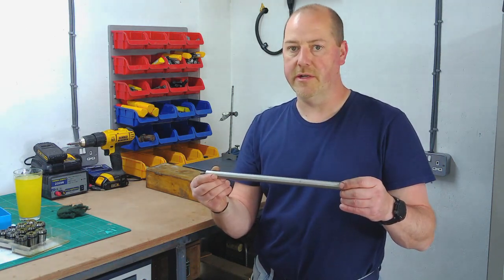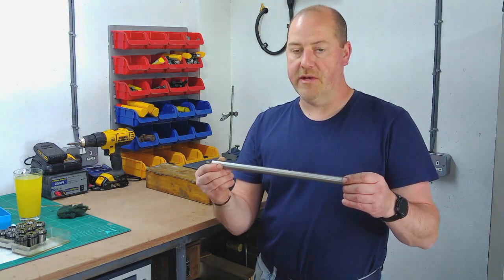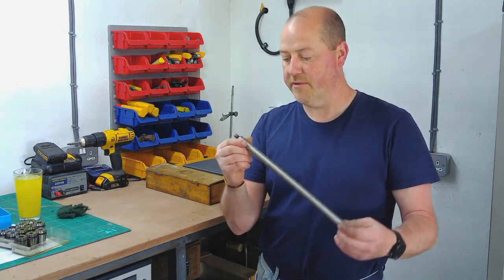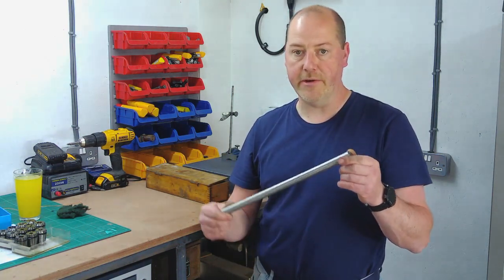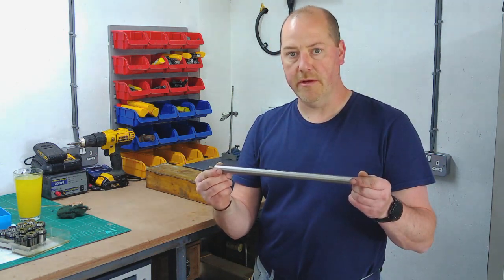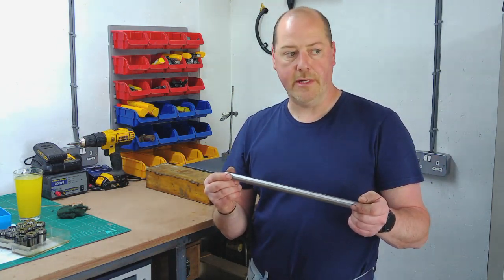It's a grooving tool, really. It's not a proper parting off tool, but it's an inserted one. So we'll get that set up on centre height, get this in the chuck, and we'll have a go at parting this off. I have run a file over this quick. I was concerned it was hardened or case hardened, but it seems to be reasonably soft, so I think it'll turn all right. But as I've said before, my lathe doesn't part off particularly well.